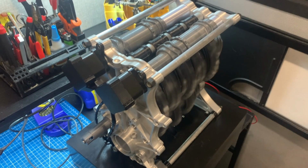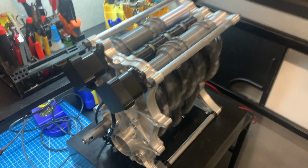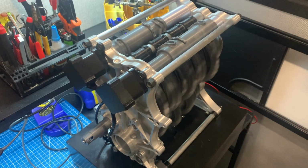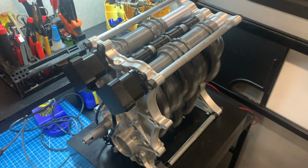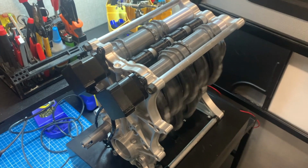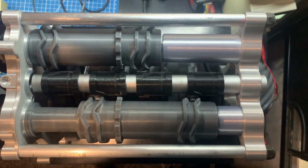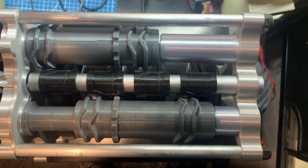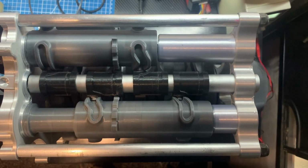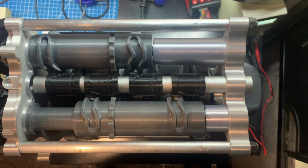This is a great way of testing the gearbox, and I played with all sorts of different speeds and accelerations. There's PID tuning for both the velocity control and the angular position control of the stepper motors. As you can see, some of these videos are in various states of tuning. Some of them have some overshoots where I've had to come back in and add some dampening, but overall it's literally like a tenth the amount of code of my previous F1 gearbox. It's so much more simplistic and easy to manage because of that SimpleFOC library. I mean, it handles wraparound and all the other issues with the encoders.